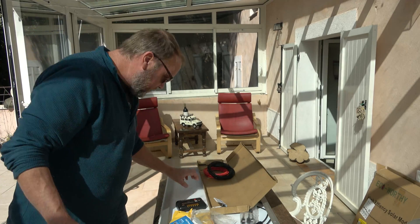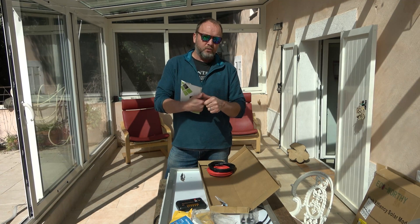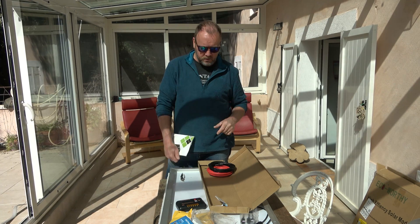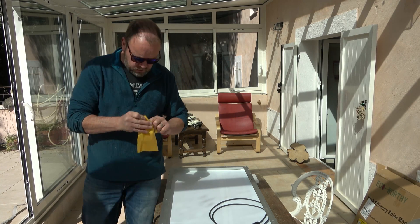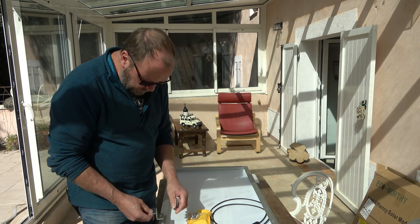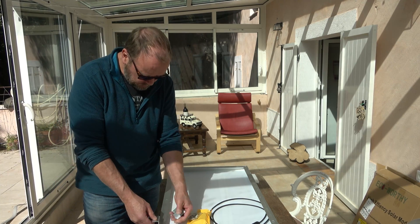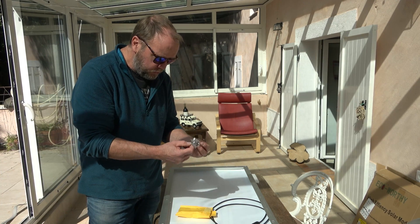The idea is we'll try two 100-watt panels — 200 watts total — and see how we go. We need to charge our camping fridge, laptops, cell phones, and lighting mainly, and also it needs to provide the ignition for our water heater. The mounting brackets are included — they're like Z-shaped brackets, four of them. Two per panel with accompanying screws, so a pair for each panel to screw into the roof of whatever you're mounting it on.